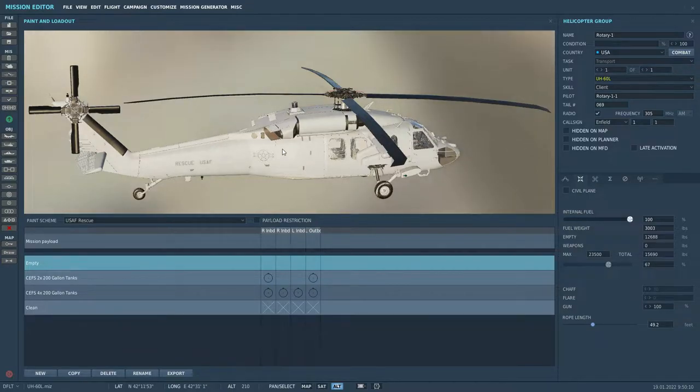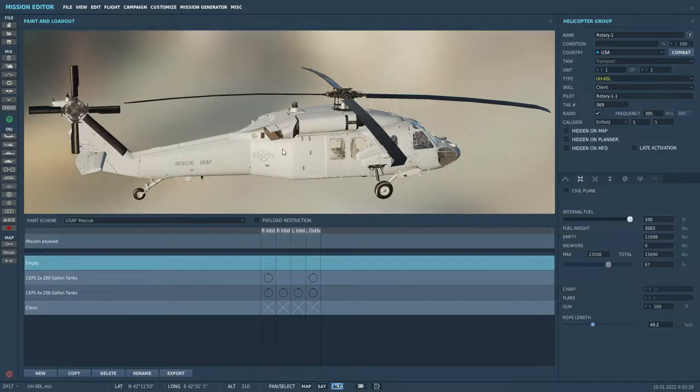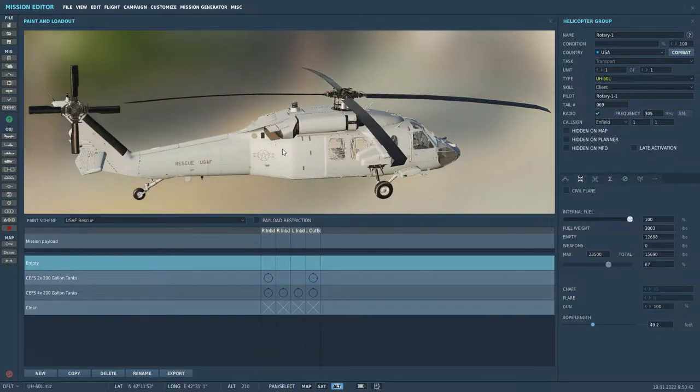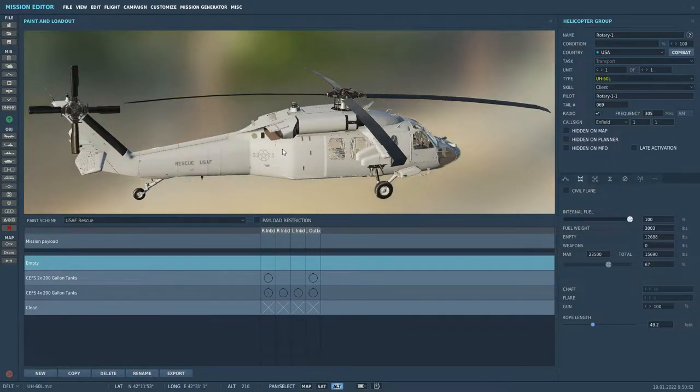And in the early days of infrared missiles, the reticule on the missile would rotate. This would pulse to get in time with the reticule as it spun, and what this could do would stop the missile from locking and being unable to launch, and also after launch, if they did manage to get a lock on, the pulsing would confuse the missile and tell the missile it was off to one side, so basically bypassing the helicopter altogether.